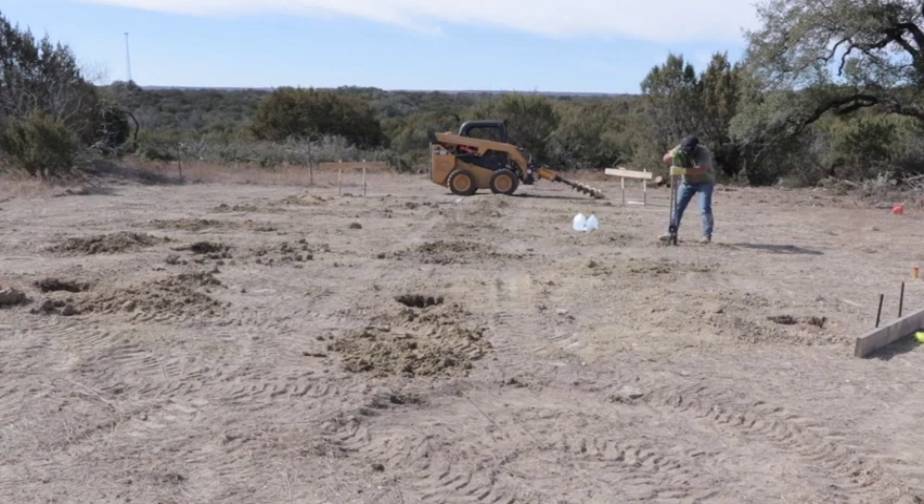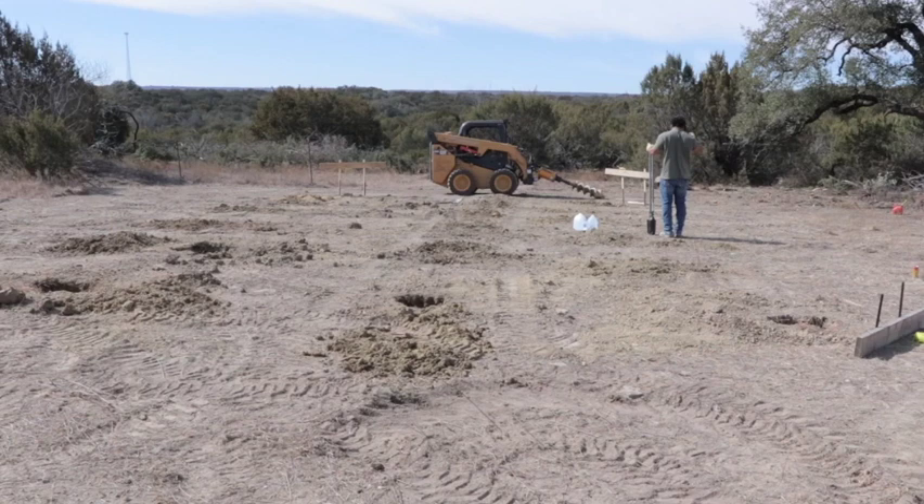I tried to get it around — I think it ended up being like 15 or 16 inches. It wasn't as much as I wanted, but it worked. Just make sure you clear out the loose dirt, make sure the bottom of your pier hole is flat, and then on the next video, guys, we're going to start pouring concrete, setting sonotube, and getting this thing framed up.